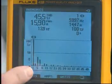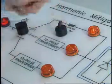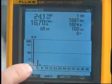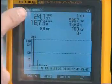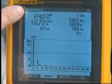Let's see the effect of putting that 5% line reactor into the circuit. Again, we see a significant drop in the 5th and 7th harmonics as well as the others above that. You can see how our total harmonic distortion has dropped from that 45% down to 24% — about half of what it was before.